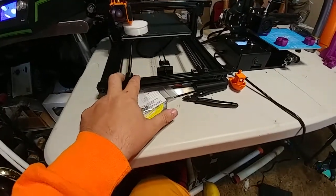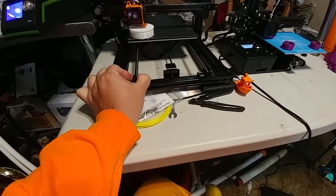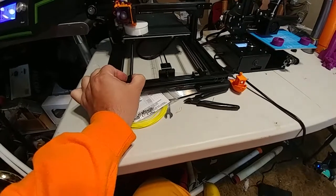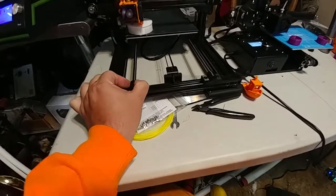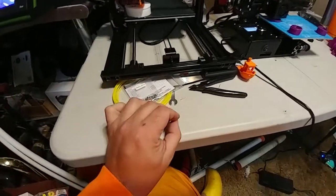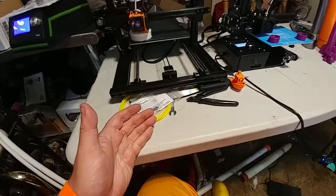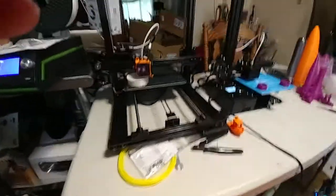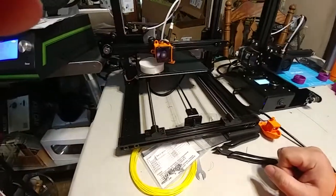I can take this bracket off and hold this rod with my finger, and as long as I was aligned correctly I would not even have to apply a lot of force — I could sit here and hold this rod in place and this printer would work just fine. There's no load. That doesn't mean there's no force. Every component on this printer has some level of force, even if it's just the 1g force of gravity pulling it down, but when we say load bearing we mean an applied force, a significant force.